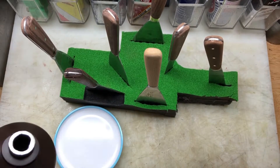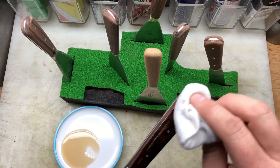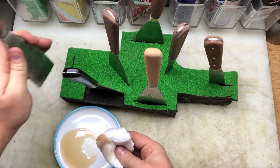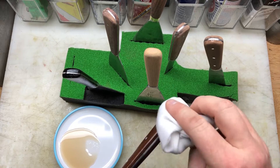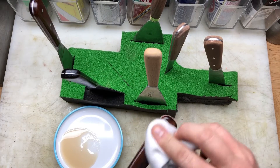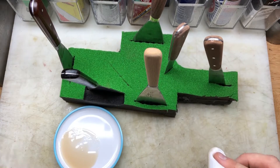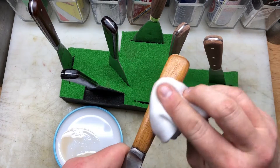I'm going to give it a go with Casey's gun oil finish — I think that should be plenty. What I'm planning on doing is giving them all one coat and then giving them a very light sand with 320 grit or something, then give them another coat and repeat that process. It certainly looks like it's bringing the grain out. I'm going to sand them while they're wet to try to make a bit of a slurry to fill the pores in the wood. It's definitely bringing out the color.